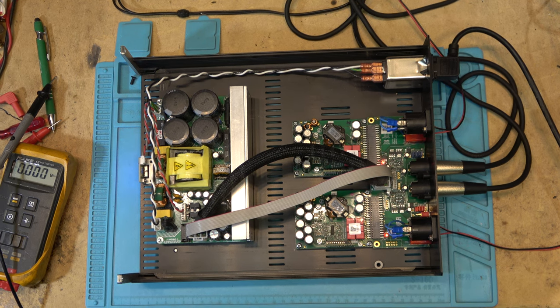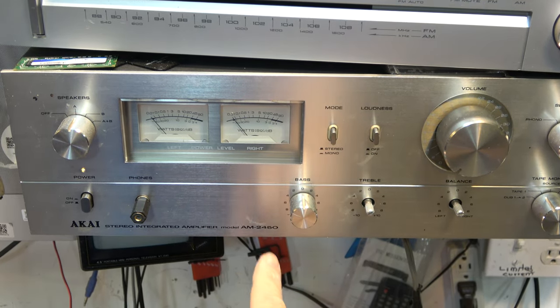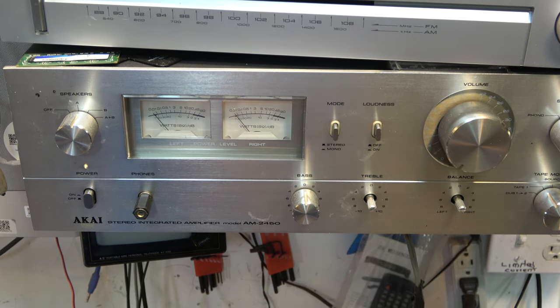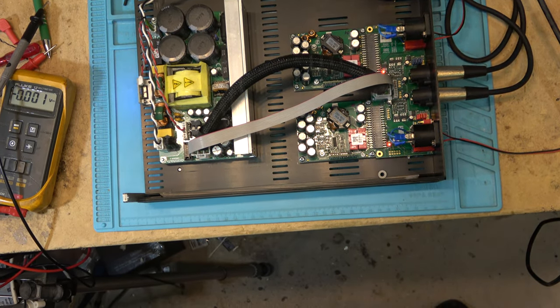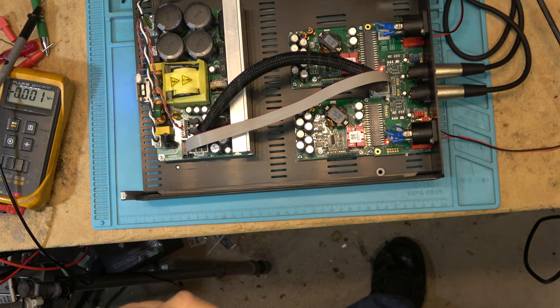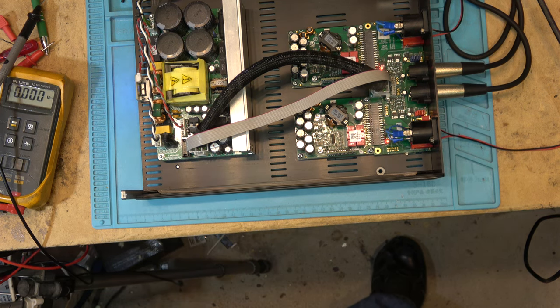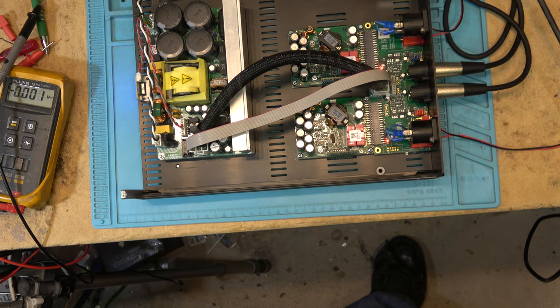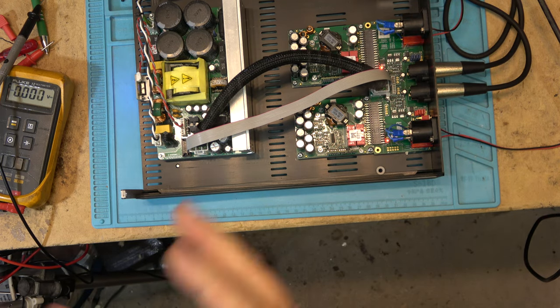It's like this thing here that I've got. I use it as my test amp. I see people asking outrageous amounts of money for units like this, and it's actually really not a very good amplifier at all. I've never blown speakers before, but I blew my tweeter with this thing without even cranking it up, just because of the distortion. I hit 40 watts or so, or 45 watts, and I popped my tweeter. That's the problem with low powered Class AB amplifiers, is that they clip.